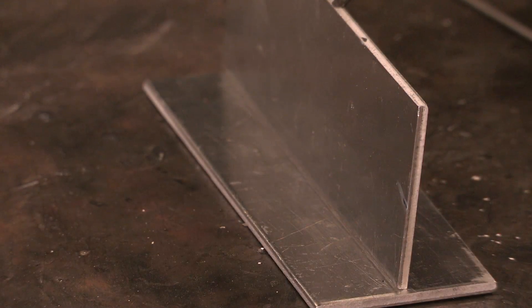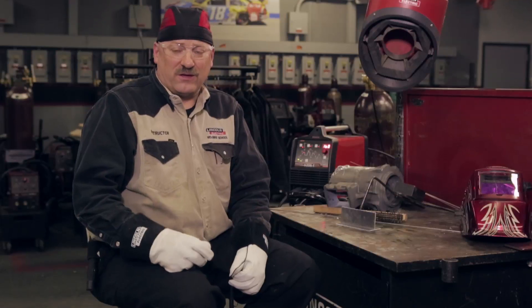What I'm going to do is take some aluminum plate and weld it with magnesium filler metal, just to show you what happens when you join the two. They really don't join, but sometimes it will fool you — it looks like it does. Before I get started, we've got to go over a couple of safety points about magnesium. When you grind or machine magnesium, the shavings are flammable. If a pile of shavings or grinding dust is left on your floor, it can actually start a fire — and you don't put that fire out with water. You have to use a Class D fire extinguisher or smother it with dry sand. You could have a dangerous chemical reaction if you put water on magnesium, and the fire will actually burn hotter.